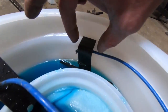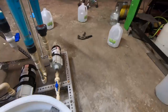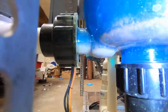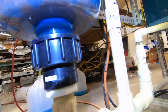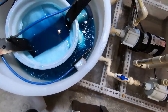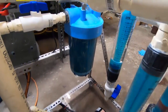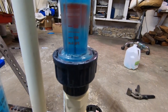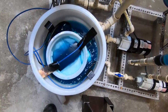I'd hate to touch this thing right now — within minutes it's already got a big coating of copper on there. This one's getting blasted with a jet of electrolytes so it'll probably look different. It's kind of hard to see the sludge at this point but it's in there. We've got a nice circular rotation of the electrolyte and the color's already clearing up from the carbon filter — I'm liking that. The flow rate is around 16 liters per minute. Everything's looking good so far.